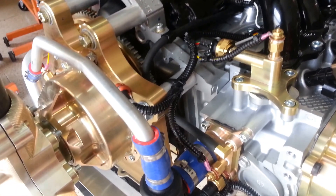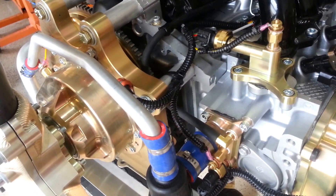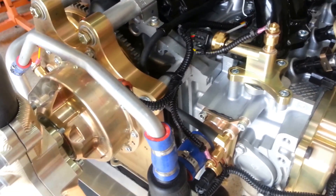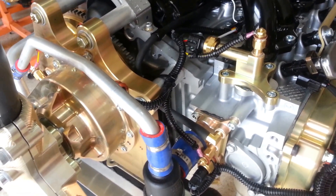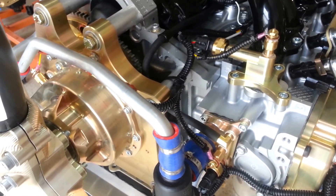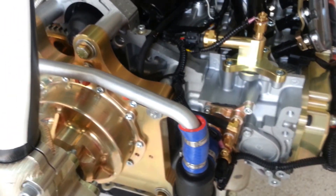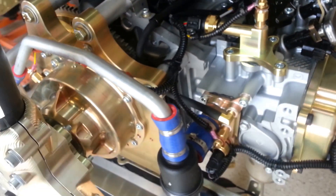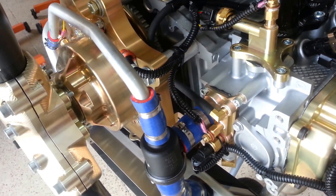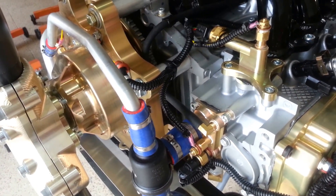That's all there is to the sensors and the instrumentation. The easiest way to go is with the Viking View. With Dynon it will be nice when it's all done, but the next procedure is to run the wires into the airplane, find where they go on the Dynon instrumentation, then program the instrument to read what you want, put the parameters in — and it can be a steep learning curve for everyone. So we do recommend our own product, which is the Viking View plug-and-play.